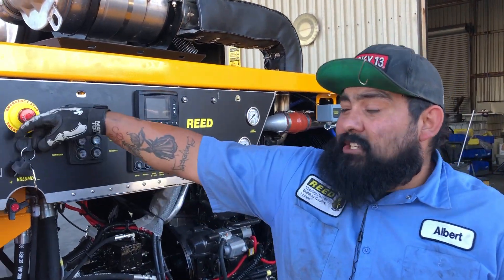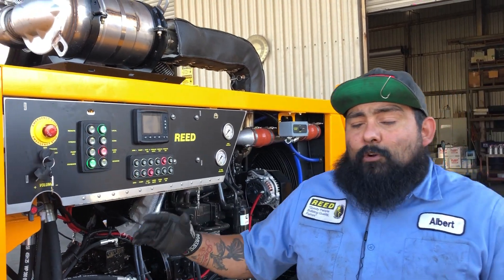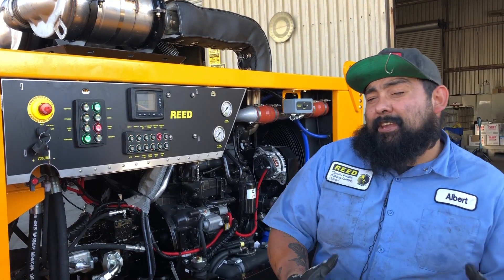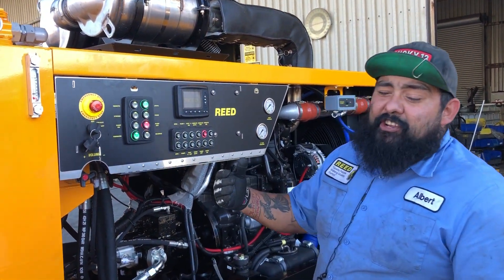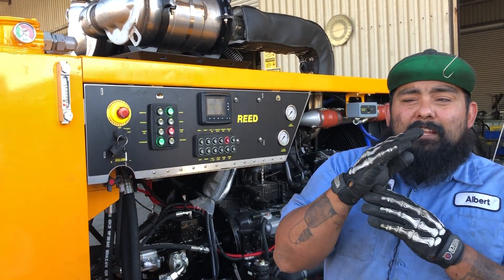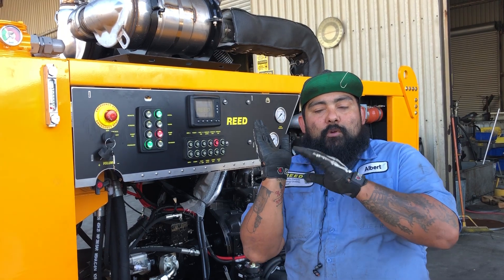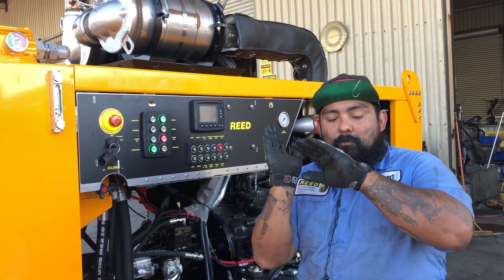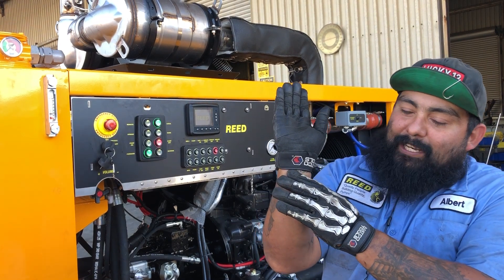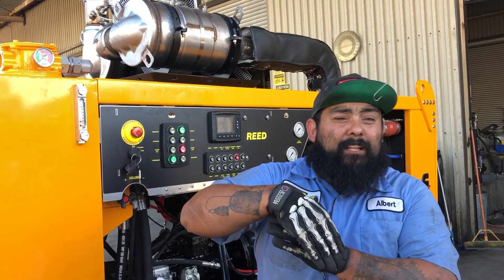This machine is good — we're running it currently. It's always a good idea to check it with warm oil because with warm oil you get better response time on your gauges. Start your engine and clear e-stop. You're gonna see that gauge jump to about a thousand, finish going up, and then when you dump e-stop by tripping it, you're gonna see it bleed slowly, slowly, slowly, and right around 800 to 1200 it should drop quickly.